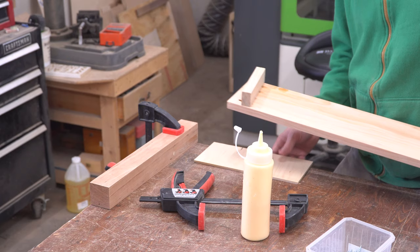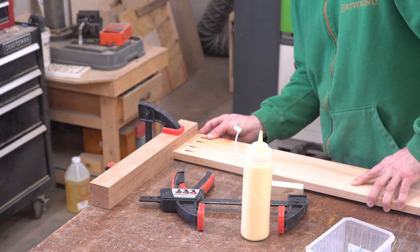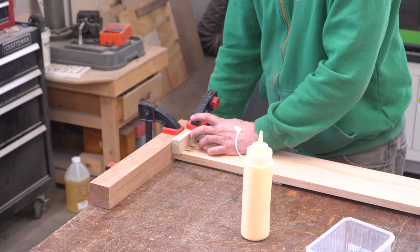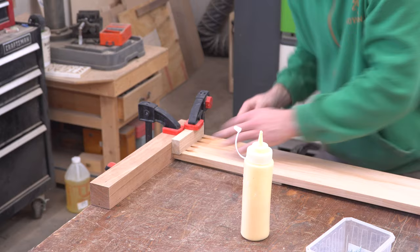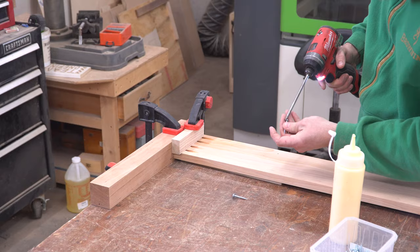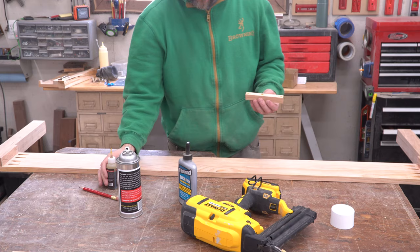The shorter head and foot rails get pocket holes drilled into the ends, and then they are attached to the legs. I'm clamping everything down to my bench so nothing shifts during this process. I have a strip of quarter-inch plywood on the bench to space the rail up from the face of the leg, and a scrap block holding the rail down so I can access my holes without running into the clamp heads. I've found that pre-drilling through the pocket holes and into the mating material helps keep unwanted splitting from happening. In these thick legs it's not likely an issue, but better safe than sorry.